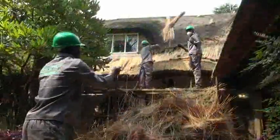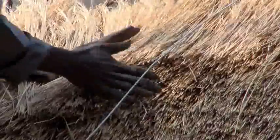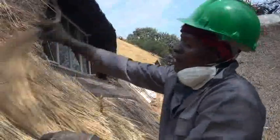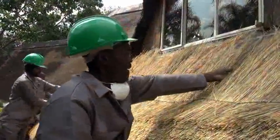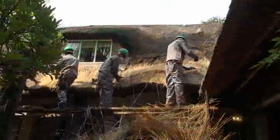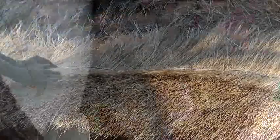The roofs of buildings are covered with layers of thatching grass or thin reeds. By carefully placing the layers vertically over thatching battens or saplings, the roof will be made completely waterproof. As a roof thatcher, you'll be responsible for pegging new thatching material on the roof in overlapping layers and fixing it securely with treated twine.